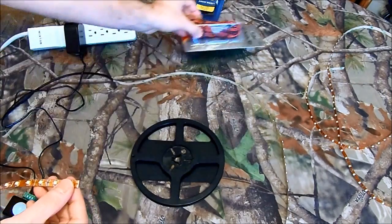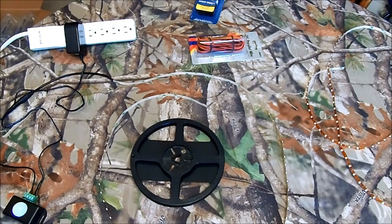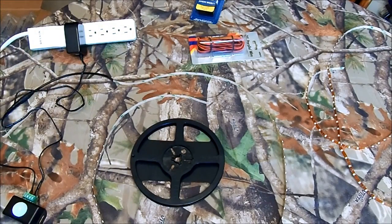You can also buy wire and solder them on. In my case, I'm not going to just have strings — I'm going to take some of these and have multiple wires coming off. Just make sure you have positive to positive, negative to negative, and don't short them out. That's just 20 gauge, 12 volt DC wire. You can buy these as complete systems — a lot of places sell them that way. If you're getting the 5050s for color change, they even have color change remote controls.